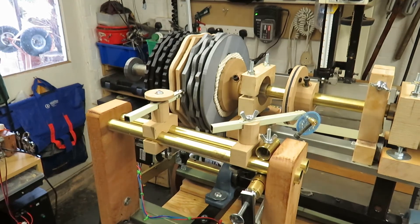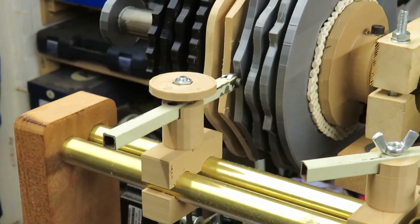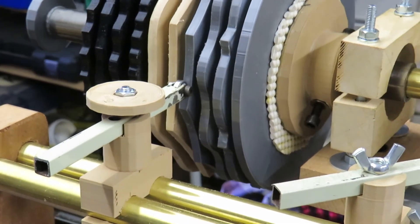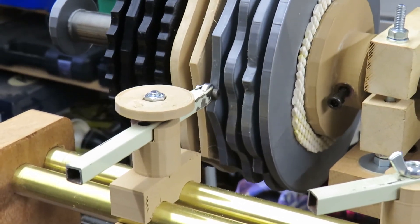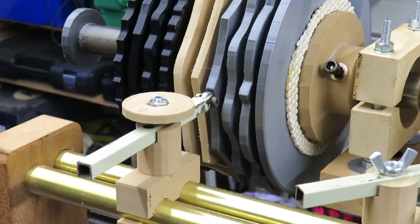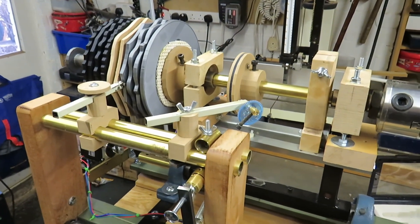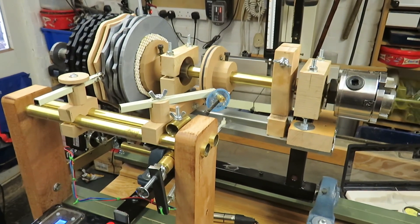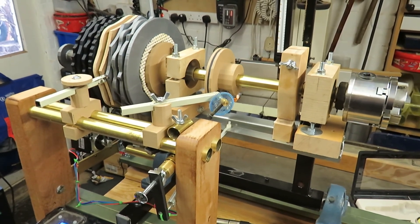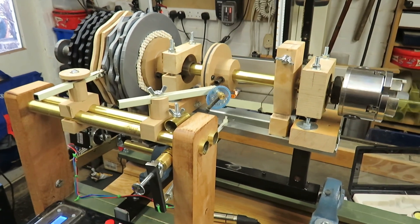Here you see the machine in action with the rosette being driven over the rubber by the stepper motor. The stepper motor can go at several different speeds — this is medium speed, this is high speed which in my experience is too high for the cutter, and this is low speed which works well on some designs. In my next video I hope to show you some of the designs that you can cut with this very simple, very cheap rose engine. Quite a lot of man hours in building it, but because this is my second rose engine, a lot quicker than the first. I hope you've enjoyed watching this video, thanks for watching.